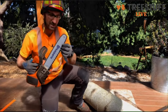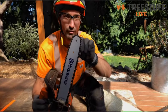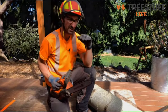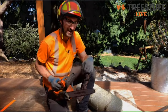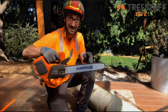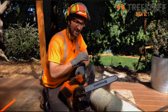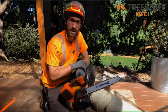And I don't know if you can see it, if I come in real close, when the chain and cutting tooth passes over the nose of the bar, it exposes more of that cutting tooth rather than it being protected by the depth gauge. So it takes this big bite all of a sudden and sticks in the wood, or can stick in the wood. Then all of a sudden, the saw kicks back. It rotates inside of the chain rather than the chain around the bar. And that kickback is a huge risk that we need to prevent